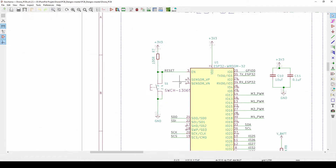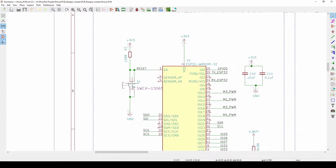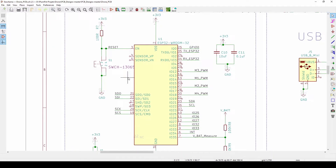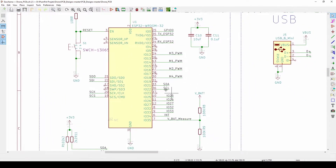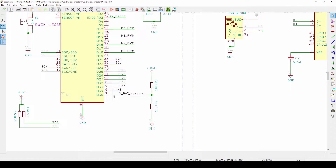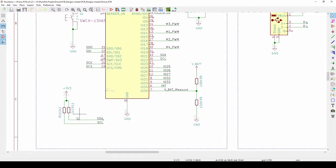Some advice: as you'll notice when designing PCBs, you always spot small mistakes. Here I have a reset button — it's actually better practice to also have a capacitor to ground here to keep the reset nice and stable, so that is missing. This button, when I ground the reset pin, just reboots the processor — useful if it's stuck in a while loop and not responding. I also want to measure my battery. The ESP32 can only handle a voltage input of about 3.3 V, but my VBAT is 3.7 V to 4.2 V, so I need a voltage divider.